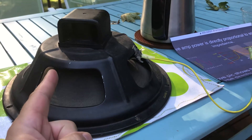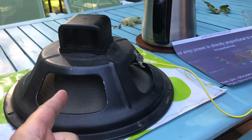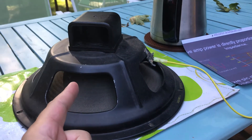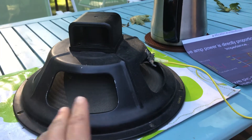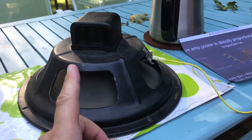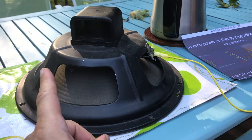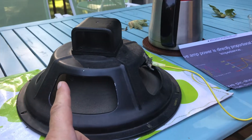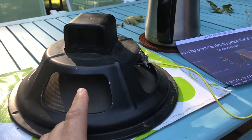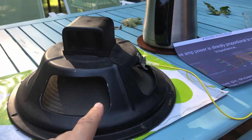The way it's usually set up, it is an under-damped configuration. Tube amplifiers are current amplifiers, and the power they put out is proportional to the impedance of the speaker over the whole frequency spectrum. On solid states it's usually the reverse — solid state amps are voltage amplifiers in the power section, and that's an over-damped speaker output.